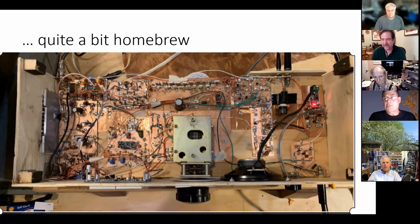I don't know whether you guys have an RF amplifier ahead of the mixer. Yeah, we do. You mentioned that earlier, that might be part of our problem, because we do have an RF amplifier going into the first mixer. Or the other thing we may need to do is put a switchable attenuator in. A switchable attenuator is great. That's better.